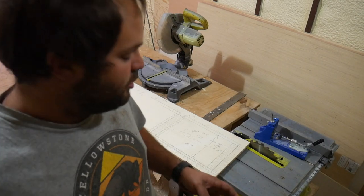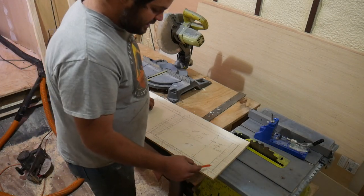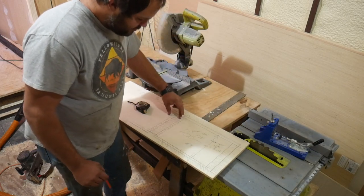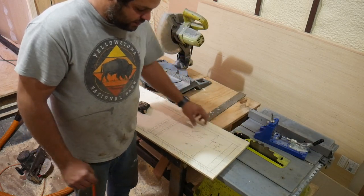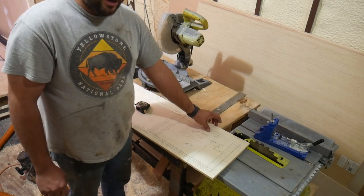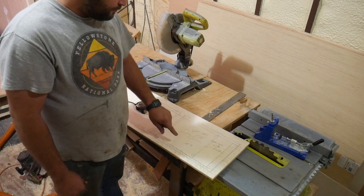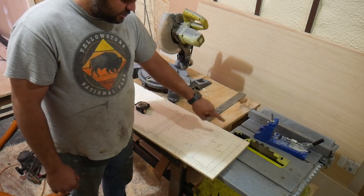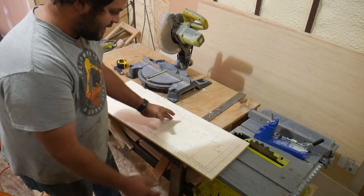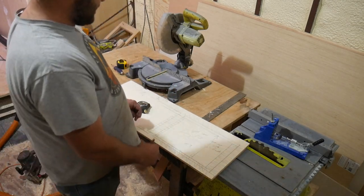So the first thing I'm going to do is get a cut list and get all my lumber cut. I've shaded these in — these are the stiles, these will all be the same, and these are the rails. So we're 13 inches overall. We've got a 1x3 up here which is 2½ inches, and a 1x2 down here which is 1½. So 13 minus 2½ minus 1½ is 9 inches overall — so these will all be 9 inches. There'll be 5 doors, so we'll need 6 of these. So 6 times 9 inches.